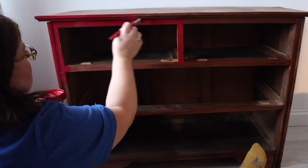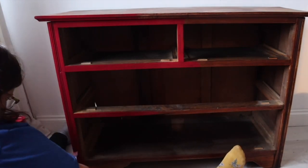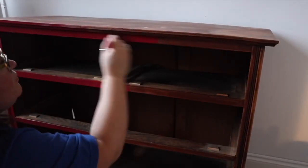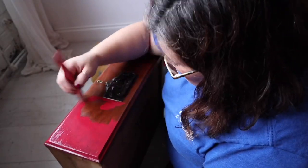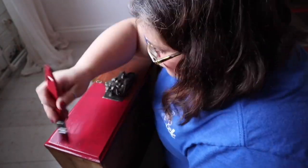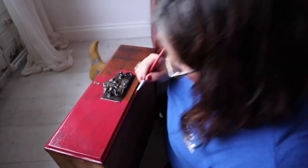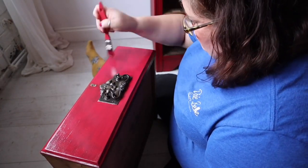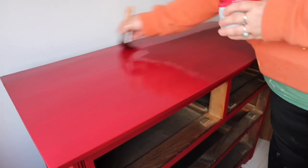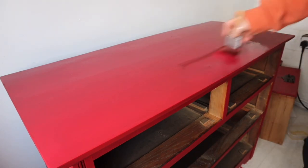A couple of features on silk all-in-one mineral paint: it has a built-in stain blocking primer, so you'll notice I'm painting straight over the top of the scuff-sanded piece — I haven't primed. It's also got a built-in top coat so there is no need to top coat silk unless you want to change the sheen level or add extra protection for something like a table top or chairs. It is really durable and has a sheen level equivalent to eggshell. I'm using the smaller artist brush to work around the lock and the handle so I don't get any paint on them, then reverting to my Dixie Belle synthetic mini for the top and sides.